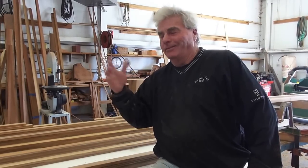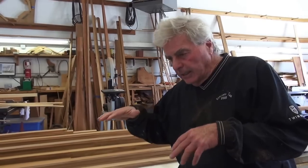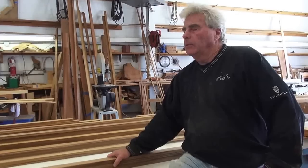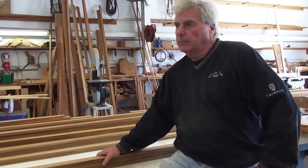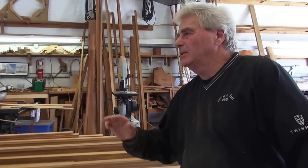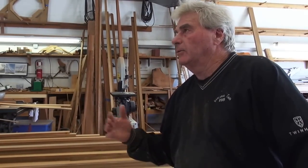There's an odd bolt. We can't put these in because it has to go in, slip underneath the coaming. Okay. So if we put these in, we pin ourselves in the corner. And we hate doing that. So we can put them in, pre-drill them, tack them in place. Draw the line, take the middle one out. But you know what? We just leave them for now until we get course number five in.